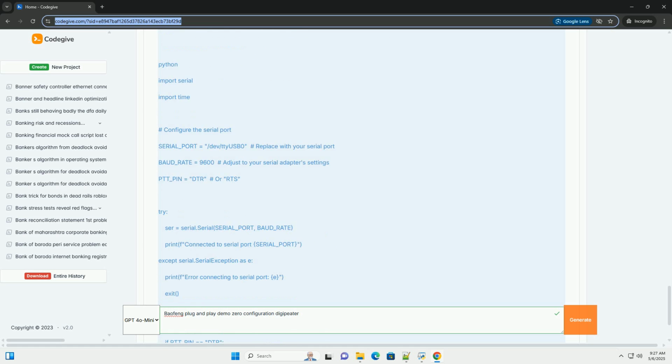Be a responsible operator: monitor the APRS network for loops or excessive traffic and adjust your digipeater configuration accordingly. If you see a problem, shut it down immediately. Update Direwolf: keep Direwolf updated to the latest version. Consider legal ramifications: you may need permission from local authorities to operate a digipeater. Always operate within the regulations of your amateur radio license. Use APRS-IS as a fallback: if you cannot achieve consistent results, you can feed APRS information to and from the internet.